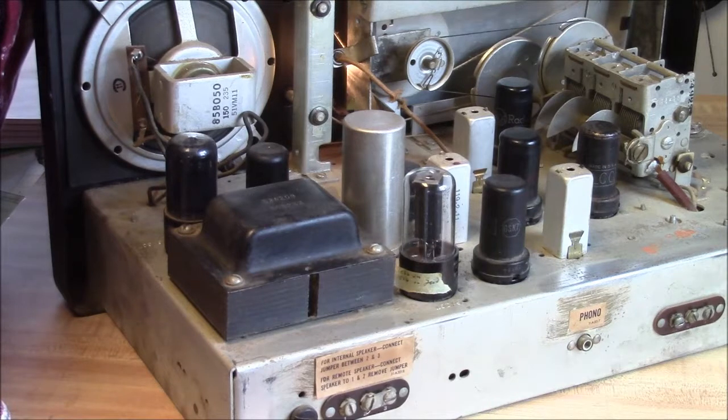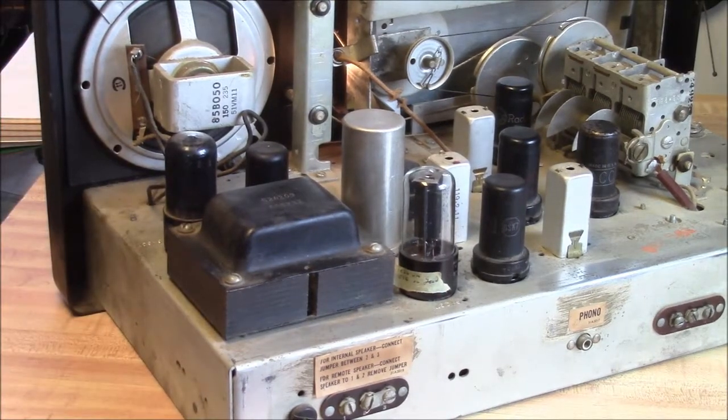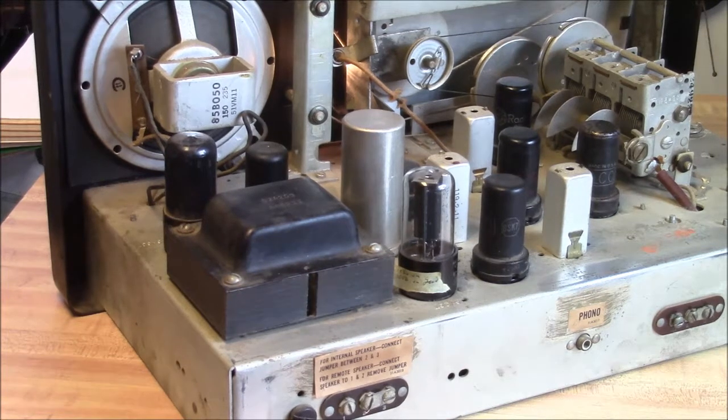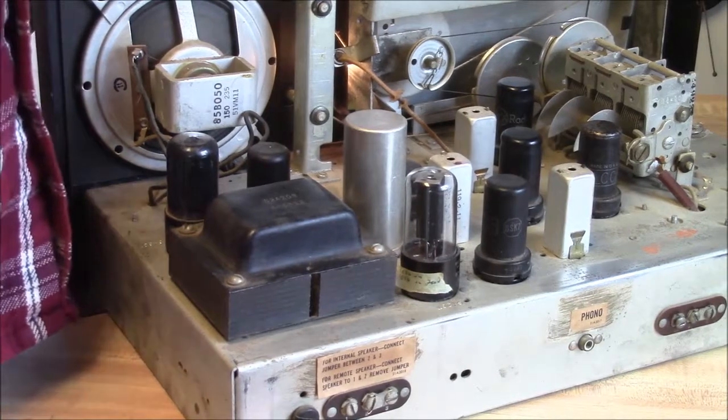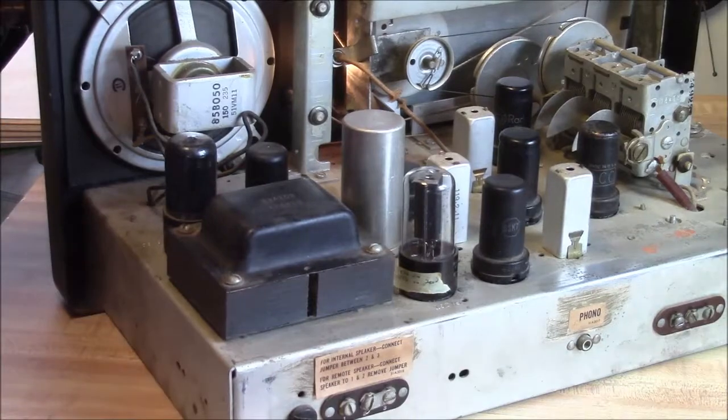A lot of those have ferrite cores or powdered iron, and they've molded little screwdriver or hex slots or some other kind of mechanism in them. And after 50 years, they're not in the superest of shape, and I personally think you'd be better off leaving something alone than breaking it up. If you're going to jack with those, I really think you ought to think seriously about taking them apart, real careful. A lot of these are just held in with little clips.